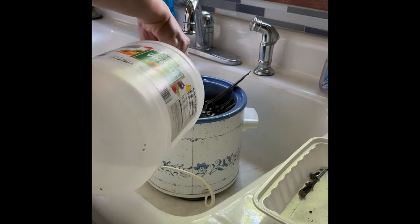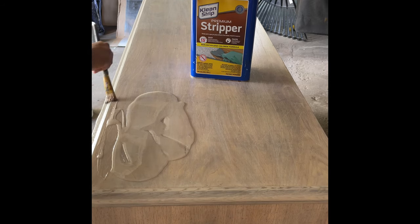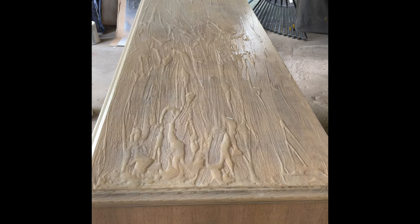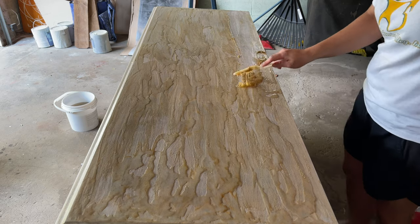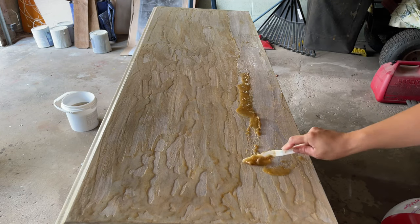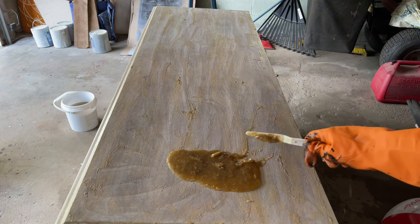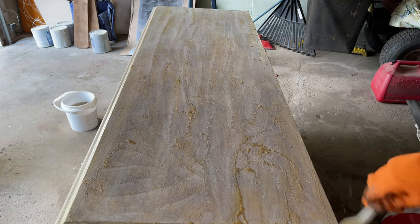I'm going to strip the paint off. This is my favorite stripper — I get it from Home Depot. I really want to stain the wood underneath but we'll have to see. I'm using an artist brush, though you should use a bigger chip brush. To remove the solution I use a sturdy palette knife from Walmart — I like it better than a scraper because I don't gouge the wood. It takes a little longer but it's worth it to keep the integrity of the wood. Make sure to wear gloves and goggles because the stripper burns when it gets on your skin.